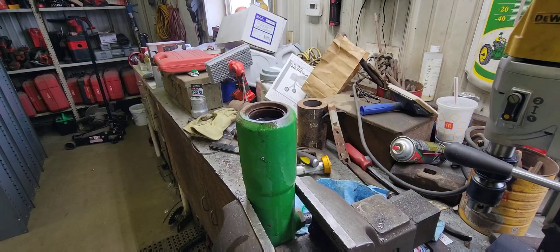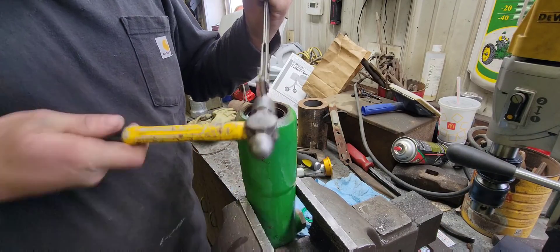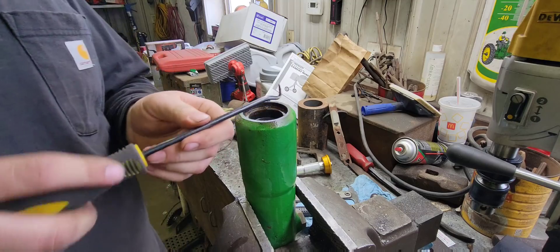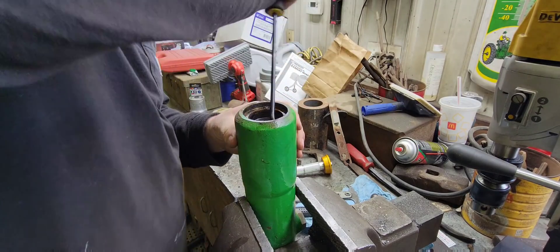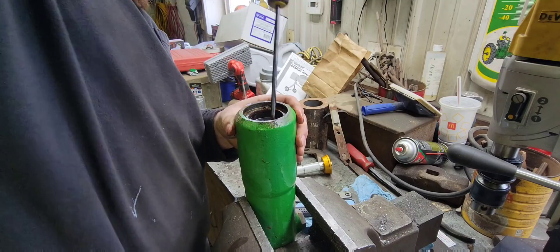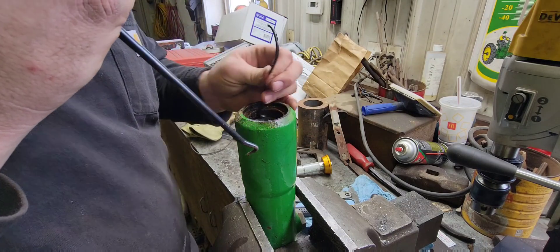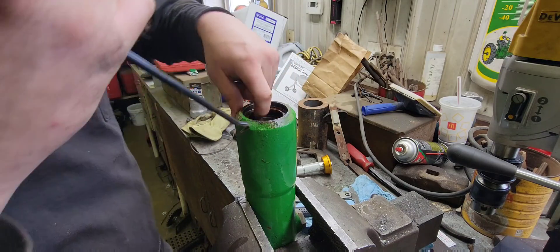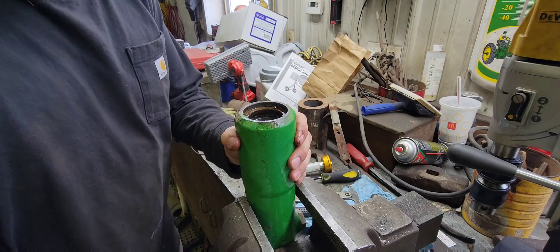We're over at the workbench now, got it clamped in the vice. We're going to get the old seal material out — we're going to take a seal puller. There's the old wiper seal. Now we're going to get down here with just a 90-degree pick and get the old inner seal out, the actual oil seal. Dig it out of the groove. As you can see, it's coming out in pieces — it's junk, it's hard. Dad's Strength got the other cylinder at the parts washer because we dug the seal out of it already and it all crumbled up and went down the tube, so he's going to wash it all up again.